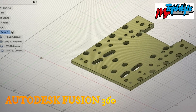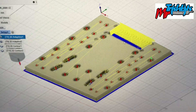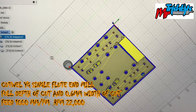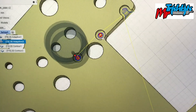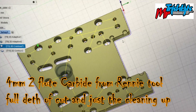It's not that interesting, it just looks like someone's been firing loads of bullets at it. I'm going to have a 2D adaptive work its way around, do a load of cuts to recess this back. I could do a contour, but I think adaptive is more fun. It takes a bit longer, but hey, it's fun. Then I'm going to adaptive out these quickly, just because I can, and then I'll do a contour to clean everything up and take it to size.